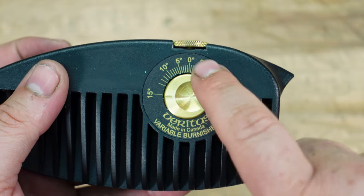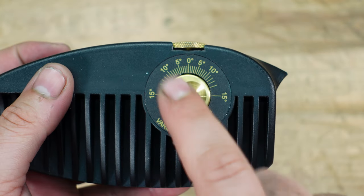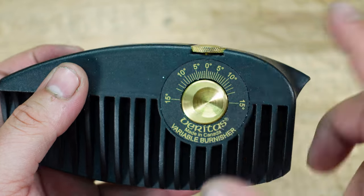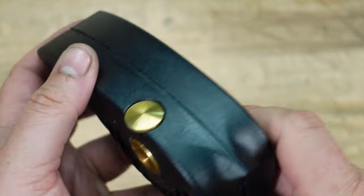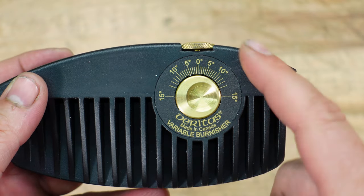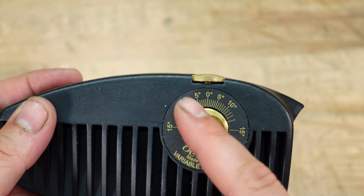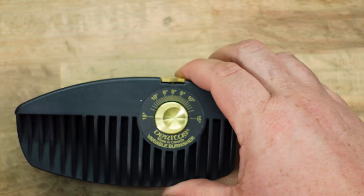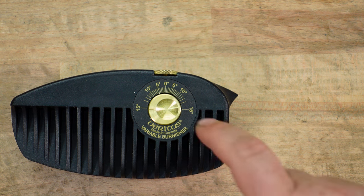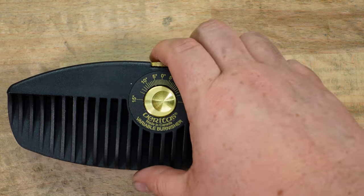To be honest, I have never turned my dial to that side. However, if your burnishing rod starts getting worn out, that's when I would probably go to that side — just know the burr is going to be on the opposite side of the card. If you have a different school of thought, go for it. If you like double-sided cards, go for it. Now, if you bought this used — and I hear a lot of people buy these used and have issues — check your burnishing rod to make sure it's okay.